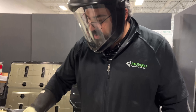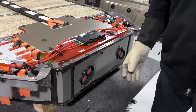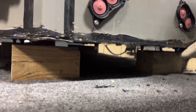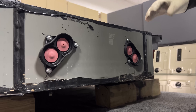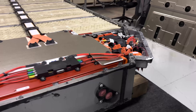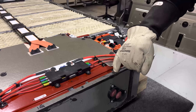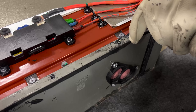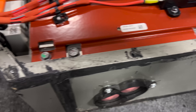They have this aluminum extrusion frame around the outside. On the bottom is a carbon fiber plate that has been fastened on — we haven't been able to get to it real close yet, but it is a carbon fiber plate on the bottom. And like we said, it is a steel top cover. There are about 80 fasteners holding the steel top cover in place. These holes appeared to be drilled and tapped in the machine shop, so that's a lot of work going on to get these rails ready. If you remember from looking at the Volkswagen ID4, they use flow drill screws — able to skip that step in the machining process and have the screw create the hole and threads as they put it in.